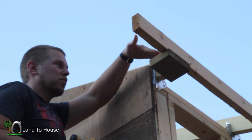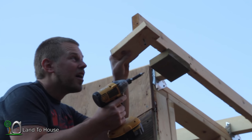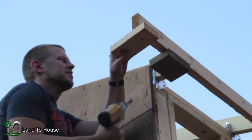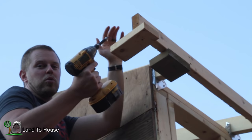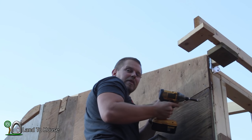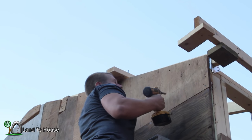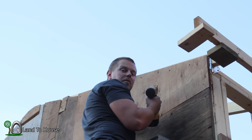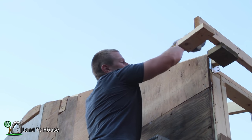In order for these ladders or rakes to be installed, I'm putting some blocking here on the end of this extra foot that we put on, so that whenever the ladders are up here they will sit on top of this and I won't have to hold it and try to screw it in the right position. I've got one more block here that I'm going to use to clamp the ladder up here, because it'll be hard for me to hold both of them while I'm going up and down the ladder.